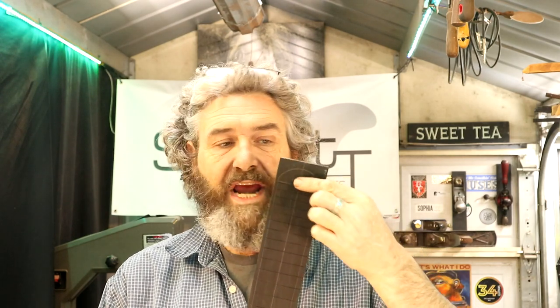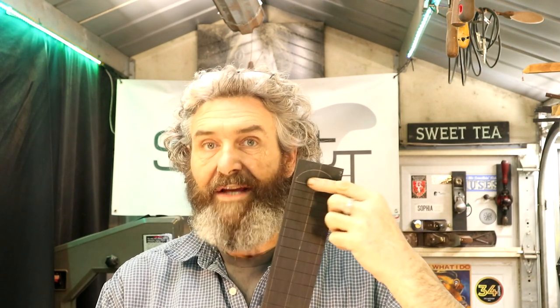I can take some chisels or files and clean this hole up and get it like I want it. I don't want it to just be a hole — I like to do a little fade cut or a chamfer down into that hole. The reason I'm doing this now is because I can't glue my fretboard on and have that half-moon thing going on without that hole to allow my truss rod nut to extend up inside my fretboard a little.